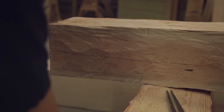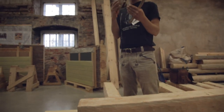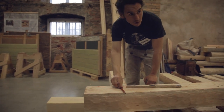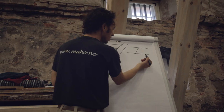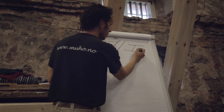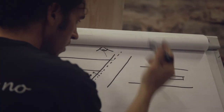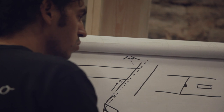Once you have done this, you do the same on the opposite side. Sometimes the cut is not perfectly flat. Most of the time it is, but you aim to have this angle, because this one you don't know. So you make the same on this side and mark here. When you do the mortises, often you do square here and here, and so it means that we'll have like a hole, or you make the tenon steep too, and it doesn't work well.